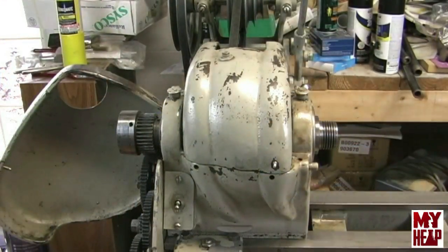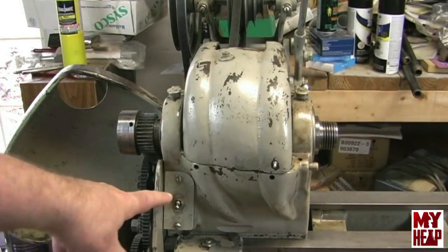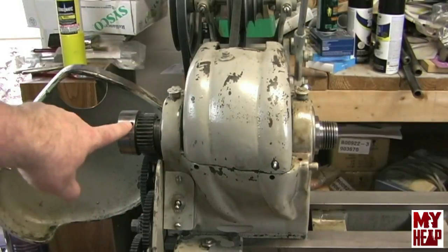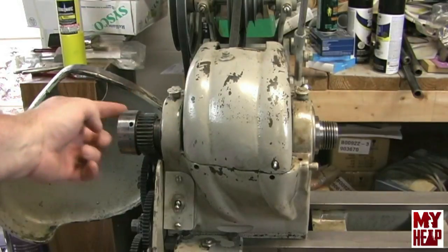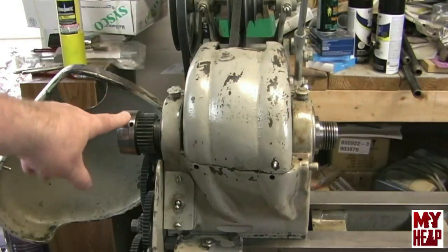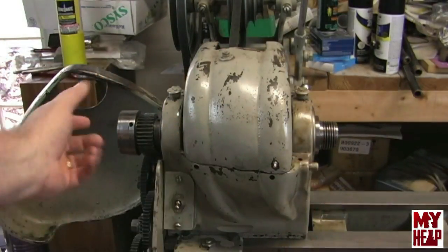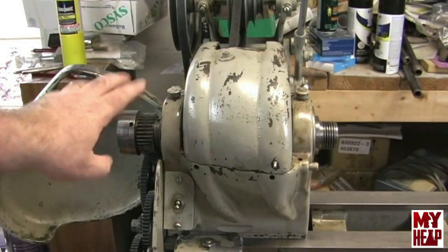Here I'm at the headstock of the machine. I'm going to run it between 30 minutes and an hour — I'll probably let it run about 45 minutes. Over here on the left, there's an adjusting collar. Most of these collars are quite thin, but this one happens to have index holes on the back — I'm not sure where it came from or if it's part of a larger attachment. There's a set screw here we'll loosen, and we'll put an indicator on this end to adjust it and push and pull until we have no play. Then we'll go an additional two teeth on the gear and lock it down.